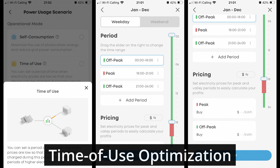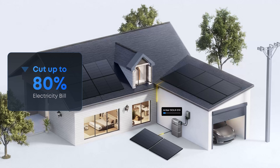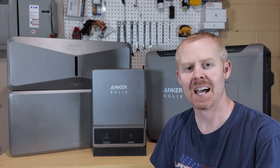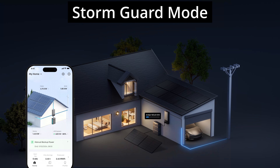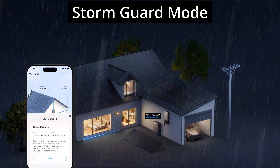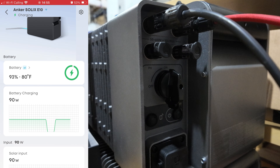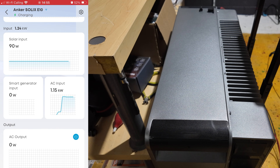You can also set up time-of-use modes, which allow you to utilize stored battery power when your grid electric rates are high, and then when rates are lower, use the grid to recharge your batteries or supply power to your home — getting around those higher grid rates. There is also a storm mode that allows the system to smartly detect when a storm is coming and automatically top off the batteries so you are 100% ready in the event the grid goes down. The smart hybrid nature of the system allows you to power your home with either solar or the grid while simultaneously using a generator to recharge your batteries, giving you a near unlimited supply of power.